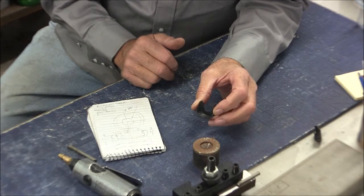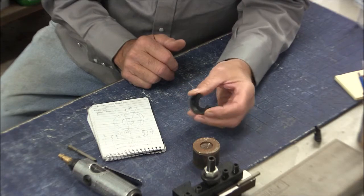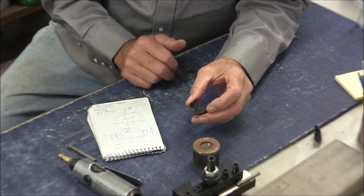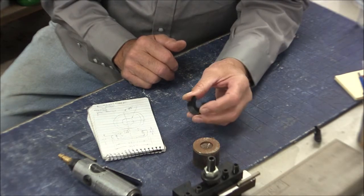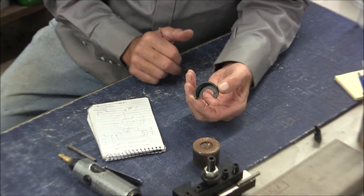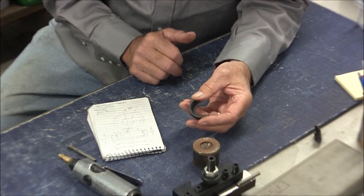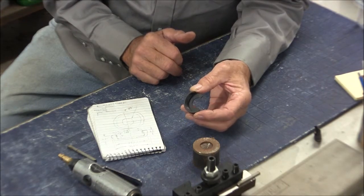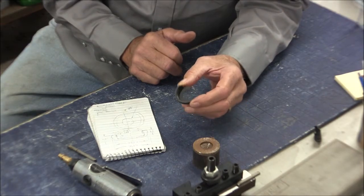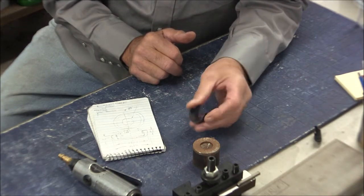And it's easier for me to use imperial on my lathe. My lathe will do metric also, but I like doing the imperial because then I can use the half nut to engage. It would be a little bit dicey with the millimeter, having to reverse my carriage every time and end up exactly in my relief slot. So that's what we'll do. We'll make it an 18 TPI thread. And the diameter, like I said, this is so unstandard, it's unbelievable. It's about 1 3/8. So it would be like 1 3/8, 18 thread.